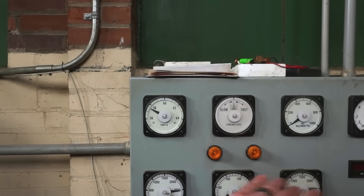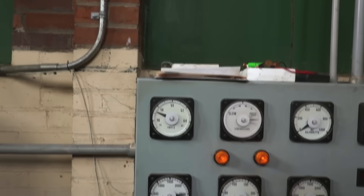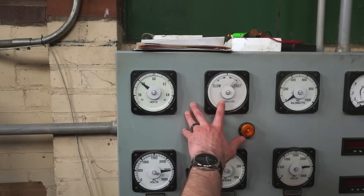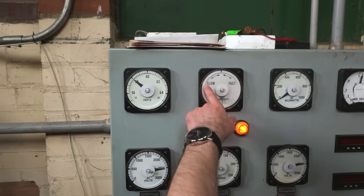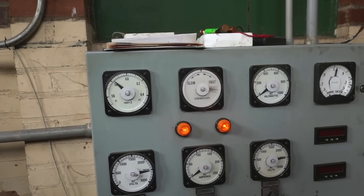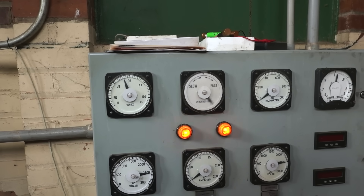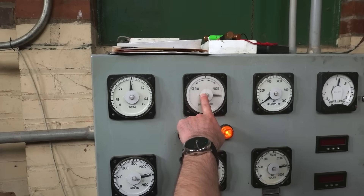That's just going to even out and everything's going to smooth out. So we're just going to kiss the wickets open just a little bit. Now this is showing our relationship of sync to the national power grid, and you can see this is moving a lot. We're slower than the grid by a lot because we're generating 58 cycles versus 60. Right now my butthole is doing a magnificent impersonation of a rabbit's nose, because I'm trying to balance 300 cubic feet per second of water, a dozen tons of spinning copper and iron, and this angry little gauge, and a river.